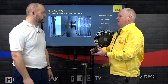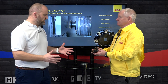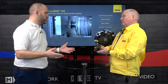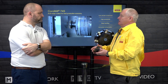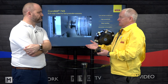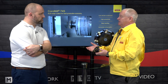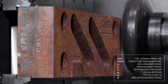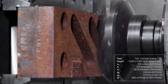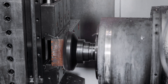And that's very repeatable. Does it need to come off onto a tool presetter? Not really — the fixed pocket tolerances are within 30 to 50 microns over a master insert. And what grades are available — what materials can we cut? We've got a full range of ISO grades: 1040 for stainless, 1130 for steel, and 1020 for cast iron.